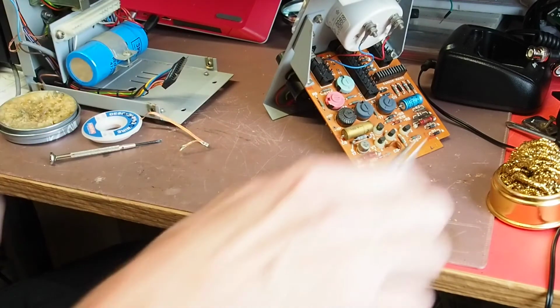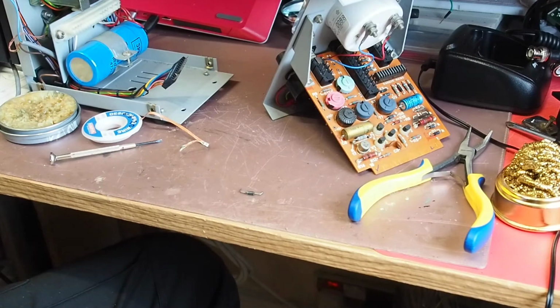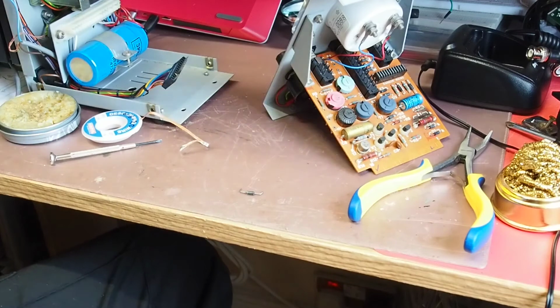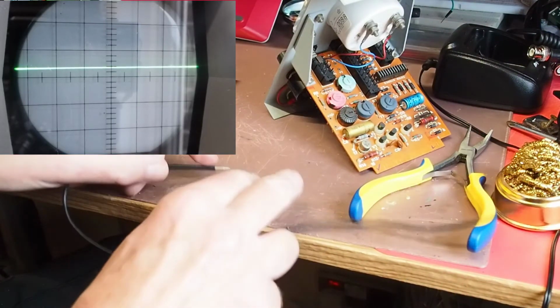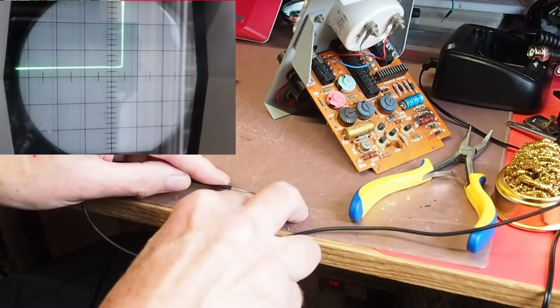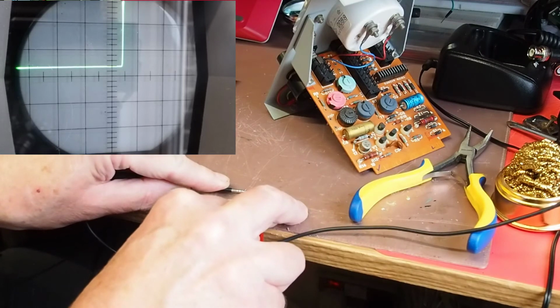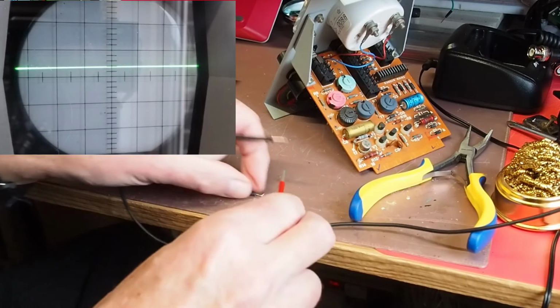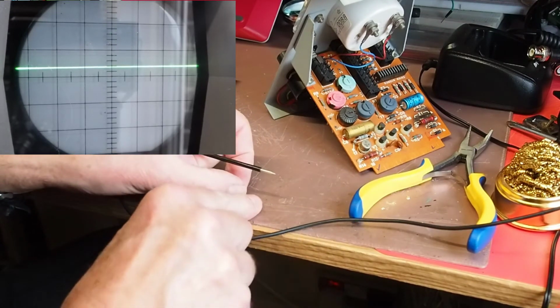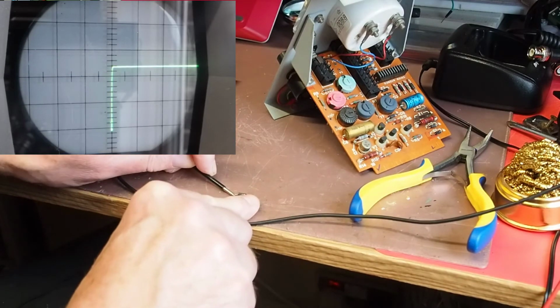So let's get the curve tracer fired up and let's see what kind of thing that's telling me. So remember, we should expect 2 knees if she's still a Zener diode. Only 1 knee there. That's not ideal. It's definitely a diode. Whether it's a Zener diode or not is another matter. Certainly my curve tracer doesn't appear to think it is.